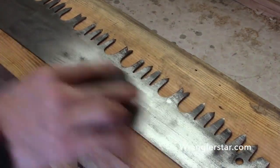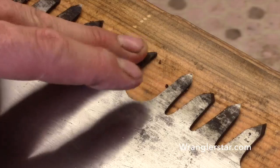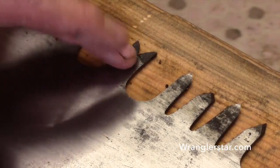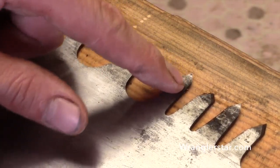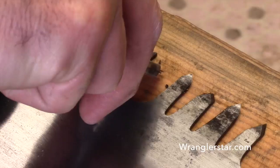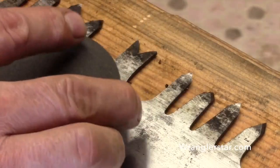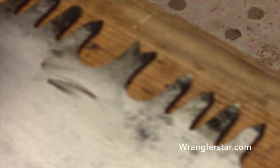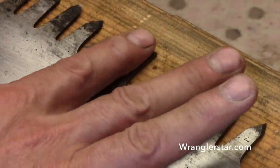Now we have the forks — these are called rakers. They don't have a set in them. You can see some black and sap on here, and then alternating teeth beside them. We do not want to get our stone up on those teeth. I can use a razor blade scraper carefully to get some of it, or if there's bad corrosion I can run the fine side of the axe stone along the raker to get it flat. We just want a clean surface — and you can feel what you can't always see.